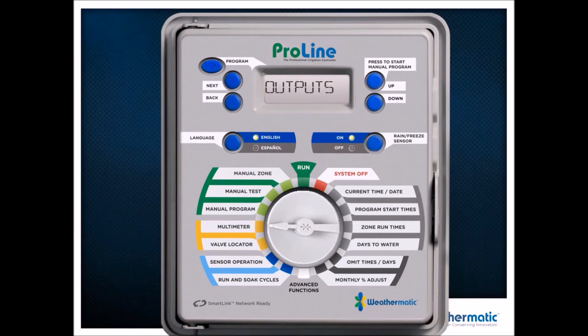Remember you have to turn the valve off. Looking at outputs on the solenoids, we measure in milliamps — each solenoid typically pulls about 250 milliamps. Four solenoids is about 1,000 milliamps, which is one amp. Most controllers in this class are one-amp controllers — that's how you know how many valves you can run at a time. If I go out there and take a milliamp test every time, I might see zone one at 250, zone two, zone three, and then zone six up around 400. I can predict a solenoid is going to fail before it fails with that milliamp test. Don't make the mistake if you tie two valves together — 250 plus 250 is 500 — don't go change that solenoid because the milliamps add up. But if you have a single solenoid in the 400 milliamp range, it's probably got water in it and is going to fail soon.